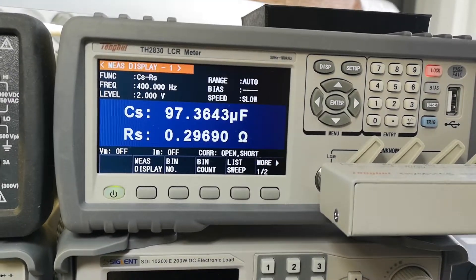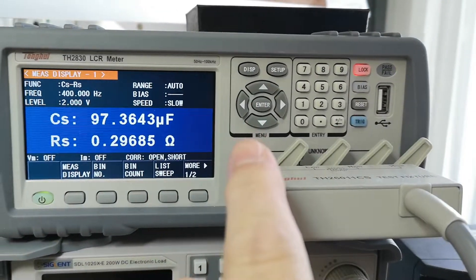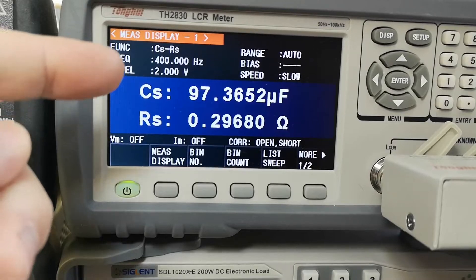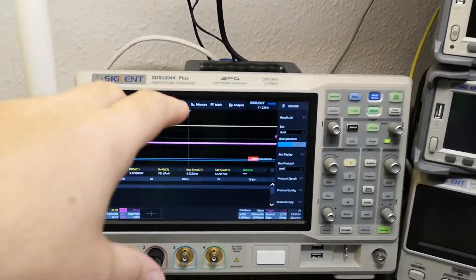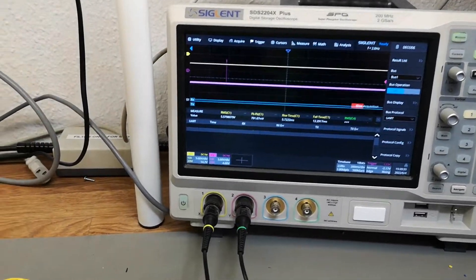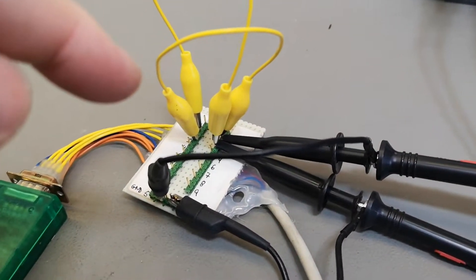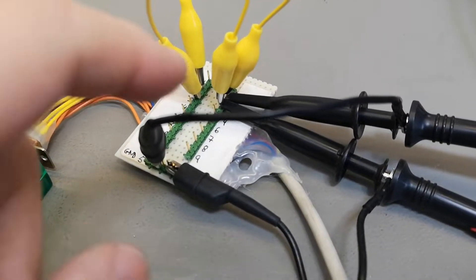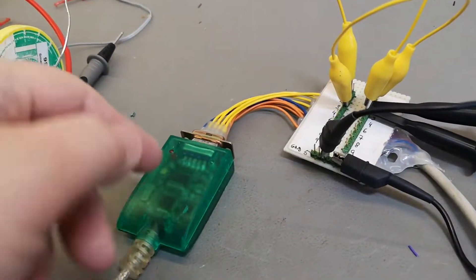Here we go with the breakthrough — as you can see it actually goes into lock mode when you send serial commands to it. I'm playing with the frequency settings and I can see that I'm actually changing stuff live on the display. I'm also monitoring serial commands back and forth, and the reply times are actually a little bit slow. No hardware handshake used at all — only pin 2 and pin 3, which are RX and TX, and you just cross it with your normal serial interface.